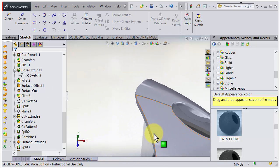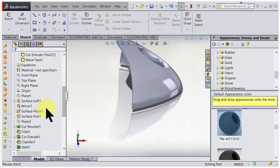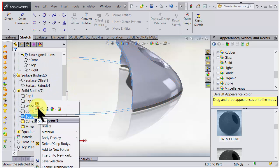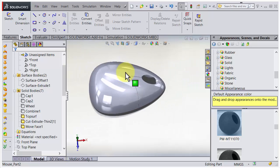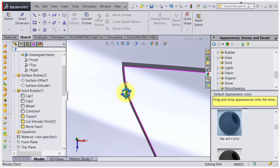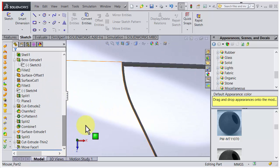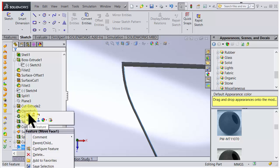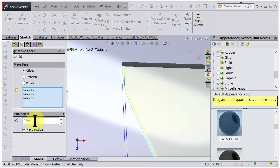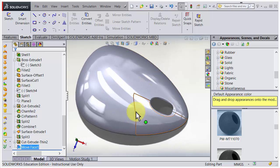We've cut off a little bit. Let's bring back the top surface to compare - I go for show. Now we have a tiny tiny gap there. I realized 0.2 is still too little, so right-click and edit to change that value. Going for 0.4 will give an obvious gap. Let's do the same on the other side.